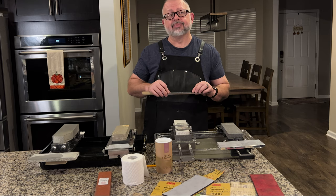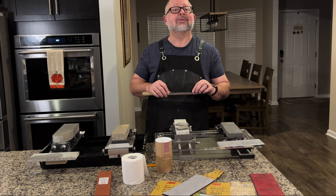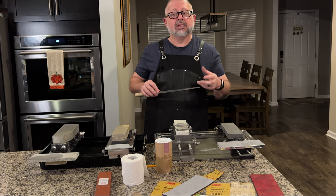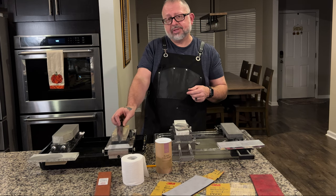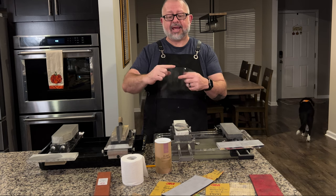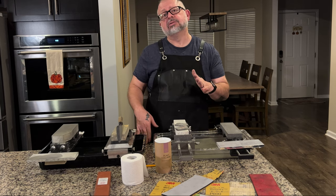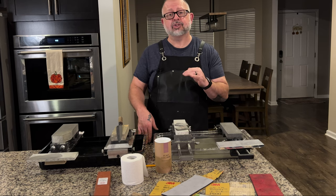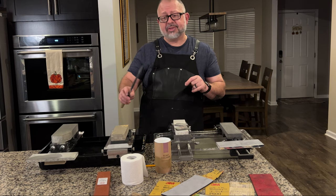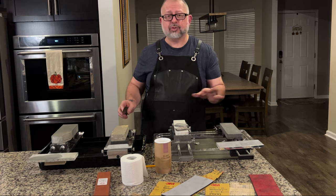The best possible fix is to send it to a professional knife sharpener who has a wheel with the same concavity to reproduce the exact scenario. My buddy Ryan Swanson at District Cutlery in Washington DC uses a belt sander with special platens — sanding in the same direction as the wheel — to mimic the concavity. That takes high skill; do your research. But for all of you who are stone sharpeners, we're going to show you an at-home fix.